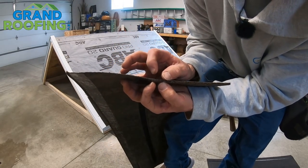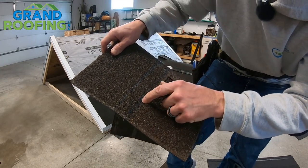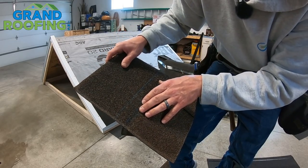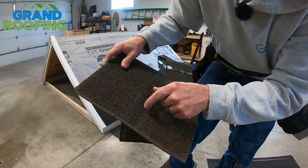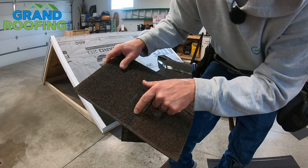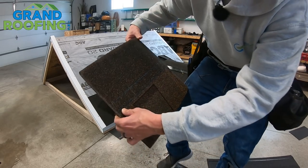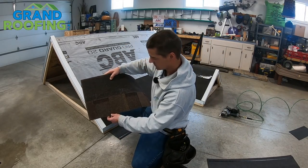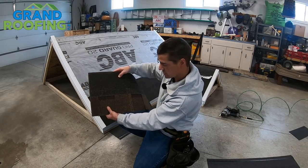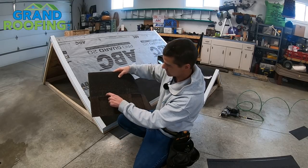This common bond is where you want your nails to hit. On a CertainTeed Landmark Pro, they have three lines — they really want you to shoot the lower middle line, but as long as you get within it they'll honor it. Why that's important: on a hot summer day on a steeper roof, the seal strips get hot and soft, and with gravity pulling, the shingle will actually slide right out if you're not hitting the common bond. It's very important to hit your common bond.